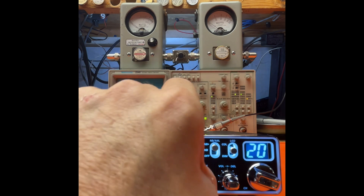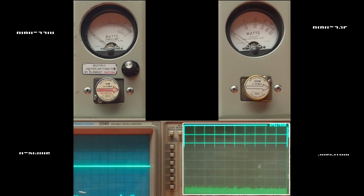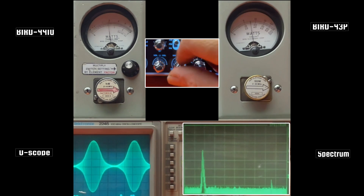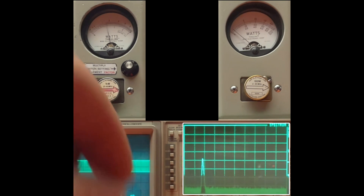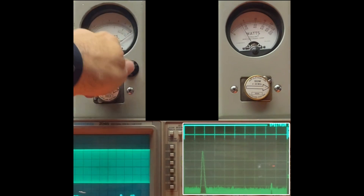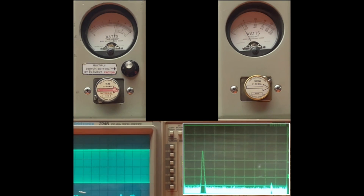Okay Colin, we got the power turned all the way down, and the mic gain is all the way down. On this wattmeter we've got about one and a half watts — there's ten watts across the top scale. Now if I turn the power all the way up, I have to go to the next scale — this is 10, 20, 30 on the bottom — you see about 12 watts carrier.